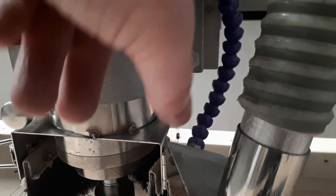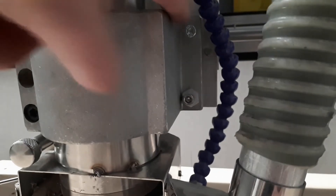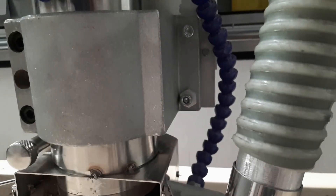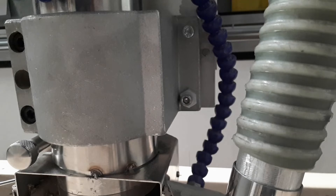By fitting it to one of the nuts, you can gently loosen each nut so it's only just slightly snug — so it doesn't actually slip when you're trying to adjust it — and then fractions of millimetres of turns on the cam nut will adjust the spindle in the plus or minus direction. You can fit two, one on the upper and lower bolts, but to be honest the bottom one adjusts it. It's very simple then for one person to quickly check how straight or how vertical the spindle is. That is my top tip if you want a very fast and easy way to adjust your spindle with one of these Chinese spindle holders: make yourself a cam nut.